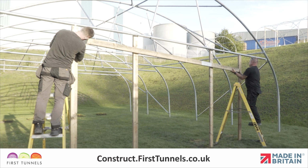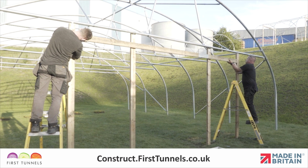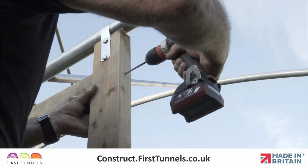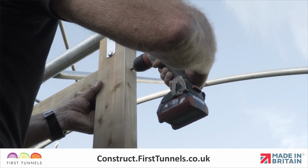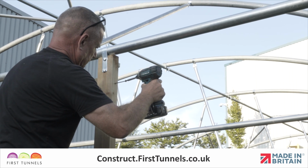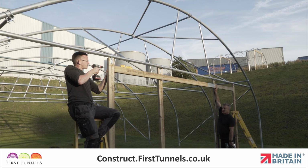Reposition the lintel. Ensure the door frame lintel is level and use a 4mm wood drill bit to drill a pilot hole. Use a 150mm screw to secure to the doorpost. Repeat at the other side.